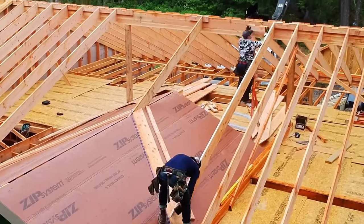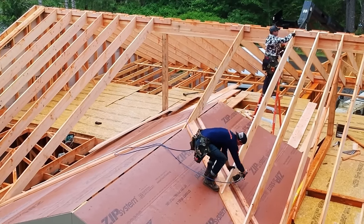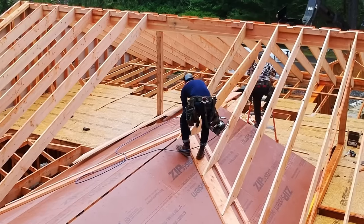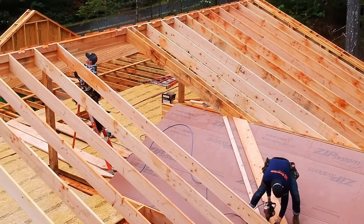Now it's time for the overframing. Becomes a little more clear how the roof fits together. So, 2x12 jacks over the top. Again, we just keep all the rafters the same length, even though we could, same species. It's all Doug fir. What am I even saying? We're keeping them all the same dimension, 2x12.